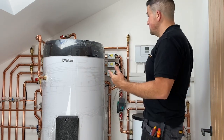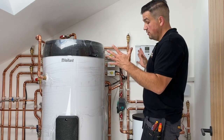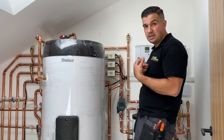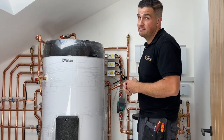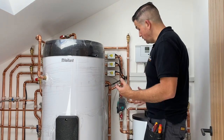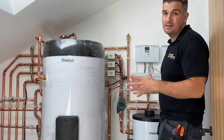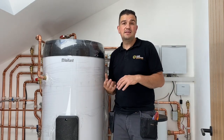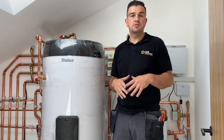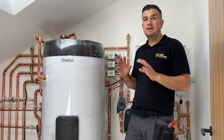As you can see from the plant room area here, we've been very fortunate to have a dedicated space which enables us to spread the system out to a point where it's much easier to maintain and to fit all the ancillaries. We've got a buffer tank, a cylinder, and all controls — everything is nicely laid out. If you've got the capacity for that facility, it's much better for us as an installer, as well as for maintenance and servicing.